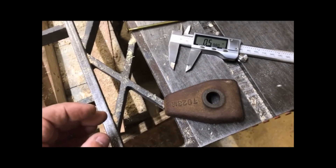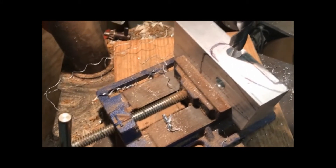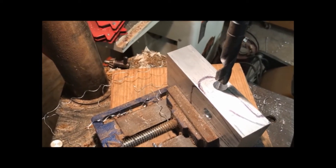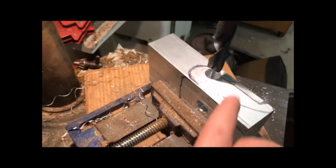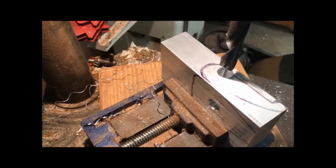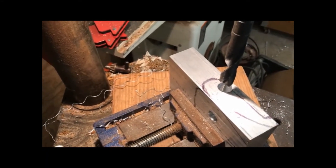When you work in a Rube Goldberg style, you just got to do what works. I've stepped up to a 5/8ths inch bit, which is the closest to what I measured the saddle bar to be, and I just made the top center hole the same. I'll get this other hole finished through, and then I'll have to try to cut it down a little to size. After that, I suspect there's going to be a lot of hogging down with the carbide burr. Luckily I've got an inline grinder I'll put the burr on and we'll see how that works out.